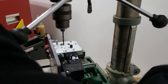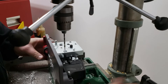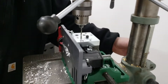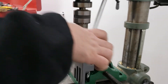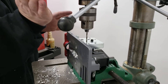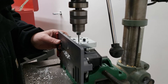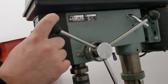There are four holes total — one of them is going to be our start hole. It's really important with these little bits to make sure it's free, no bind, and to lock your plate. Because if you torque it just a little bit, you'll bend your bit and it'll probably break. One finger of pressure — it's going to be like an eighth inch of aluminum.